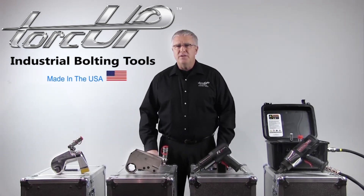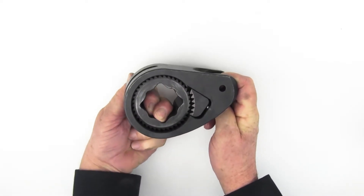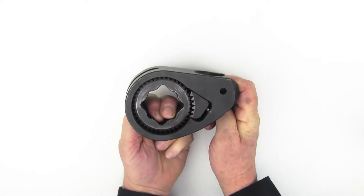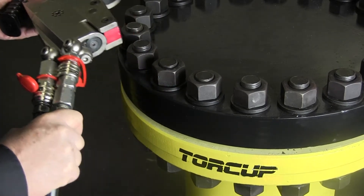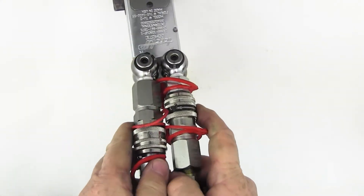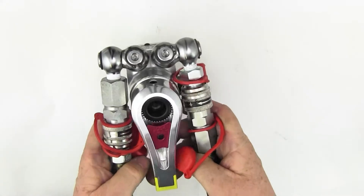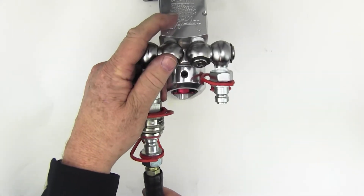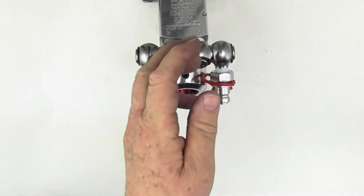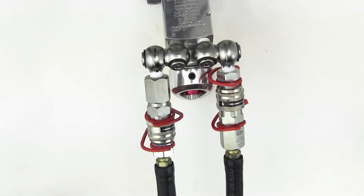Our hydraulic torque wrenches have three internal moving parts, the fewest in the industry, allowing superior reliability and ensuring low cost of ownership. Non-locking six tooth engagement segment. The 360 by 360 swivel design allows for unlimited individual movement of duplex hoses. Quick connect no-drip female and male couplers allow a quick, secure, reliable connection while eliminating the dangers of threaded couplers.